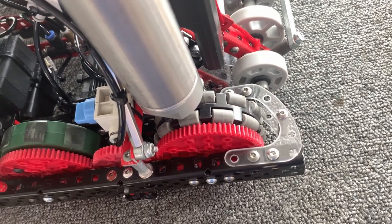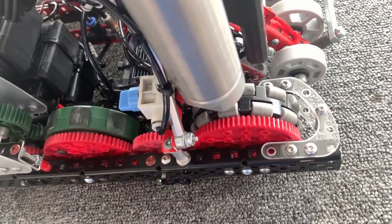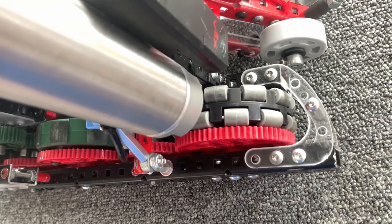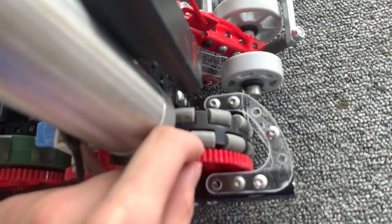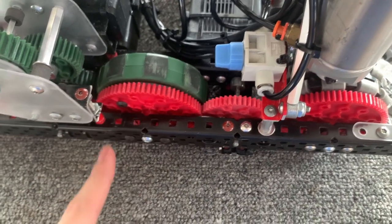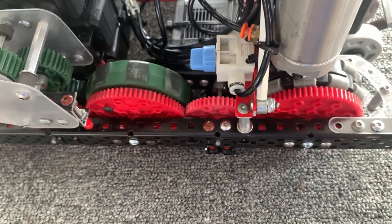Lastly, if I'm running a 400 RPM drive, I'm going to be using 48 and 72 tooth gears. These ones actually only come in high-strength variants, so they wouldn't actually fit normally in a normal three-wide drive. So to solve this problem, I basically use my lathe and I thin down all of my gears to low-strength variants over here. I'll probably attach a video by the side just showing the process. I chose to use these older 3.25 inch wheels because I don't have any new ones.